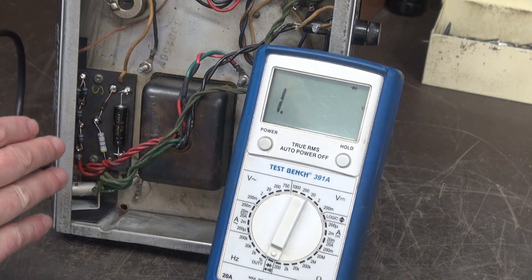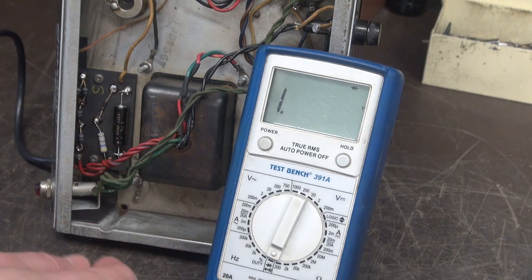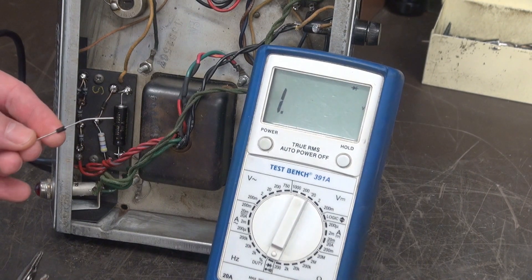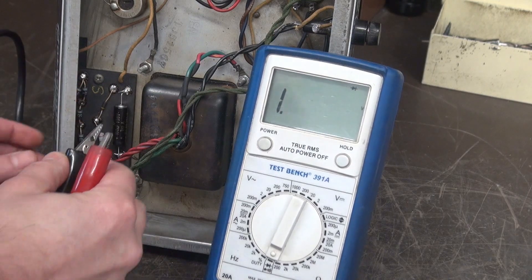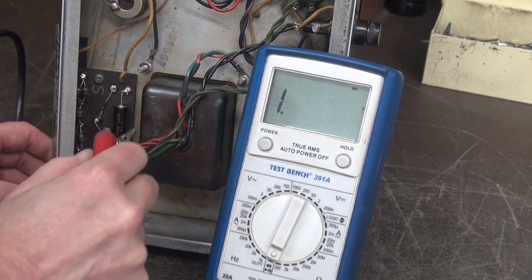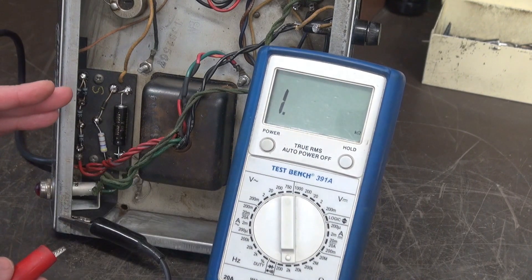Before I change the diode, let's go ahead and check it with the multimeter. To do this you need to set your meter to the diode check function — not ohms. This actually outputs about 2 volts DC, and when you put the diode across it you'll see the voltage drop when the diode is conducting, which is usually around 0.5 to 0.7 volts. This is a 1N4007 diode. Put your black lead to the band — there's the diode turning on at about 0.57 volts. Now let's do the same on the one inside the amp — and you can see she's wide open. The question is: what popped that diode? Is there a short after the diode in the negative bias circuit? I don't believe there is, but it's still a mystery because normally you don't see this diode blown. I don't see any direct shorts.